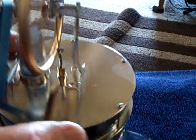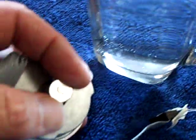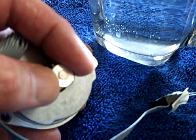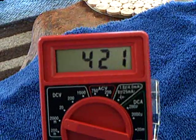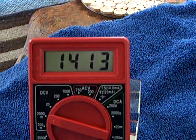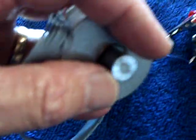But there's very little torque to it, and that's where this little stepper motor came in. You had to have something to produce the electrical energy that didn't have much turning friction, and this doesn't — it turns very, very freely. Let me show you how I can turn this and make the voltage go up just by turning this. It's a very, very easy turning stepper motor. It didn't work very good for that charging thing, but it worked real good on this Stirling engine.